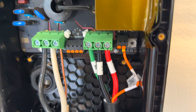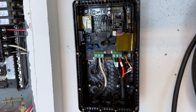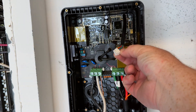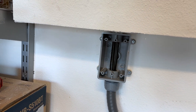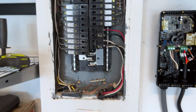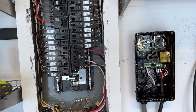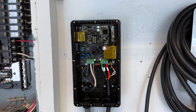So 60 amps, 80% of that is 48 amps. This is all wired up. All we're going to do is plug this connector in, put the face plate back on, put the cover on the junction box, and then put the breaker box door right back on. Then we'll check out the status of our new charger.